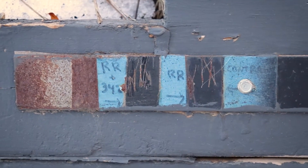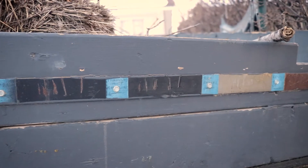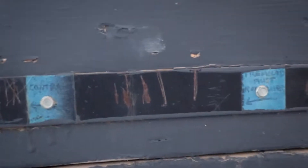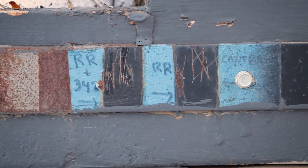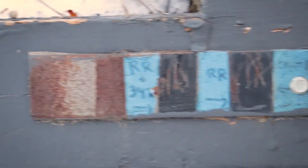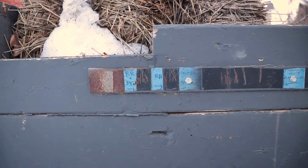So these two small ones here, if you remember, well we'll start over here. These bigger ones were clean, very clean, well-prepared metal, almost immaculate, then painted over top. Not the best for a rust test. So these smaller ones were part of the control. I then did no prep and just painted over top just to see if they would rust any different than the very, very clean metal, having a little bit of rust already there and then you just paint over top with little to no preparation like the average person.